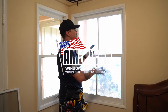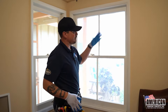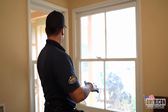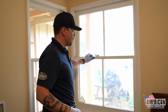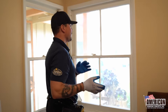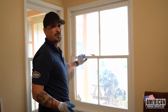We're on the inside of this window. It's an older double-hung window that they painted and sealed off, so now the bottom no longer slides up and down. The reason we're doing this is because we only have two windows in this bedroom. California has a code called egress and ingress — we have to have at least 5.7 square feet of opening to allow for an emergency exit or entry.